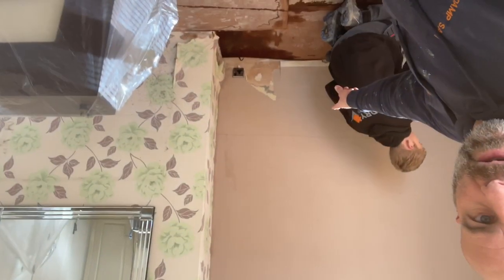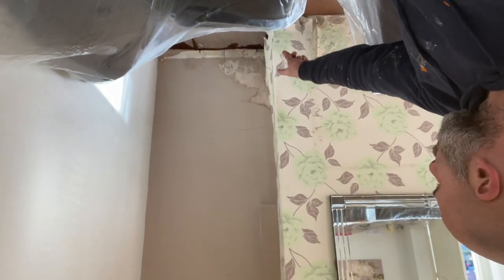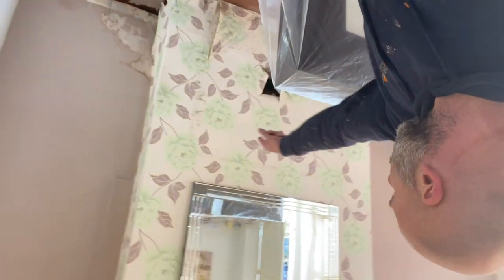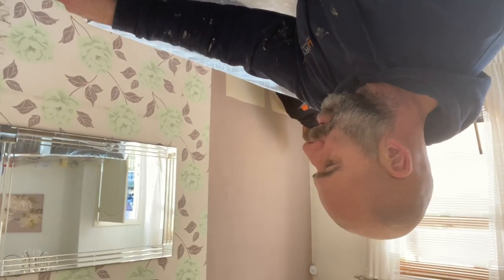Just take your wallpaper off and you can see where it's all wet at the bottom. It's wet through down here. I've took the skirting off and we've boarded up. We'll take the wallpaper off, then we'll pack that bit off - open it down to the air. There'll be a gap in the flooring; we'll fill the gap so there's no cold air, no damp air coming up. We'll drill and inject it on the brickwork at the first brick joint above floor level.